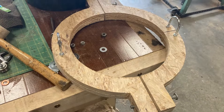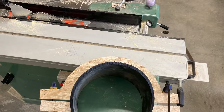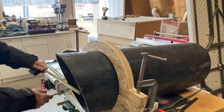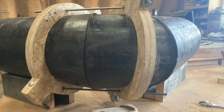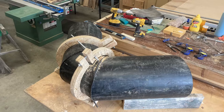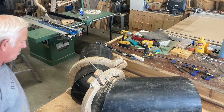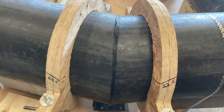We used a heating plate to heat the plastic and fuse it together, but we needed to come up with a way to press the plastic together with enough pressure and hold it consistently while the plastic fused. We came up with these wooden clamps and some ready rod, and it worked okay. We've since improved on the design, but it wasn't until almost the end of using all of the pipe — it worked.